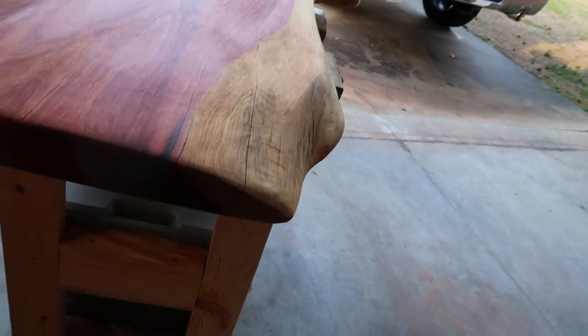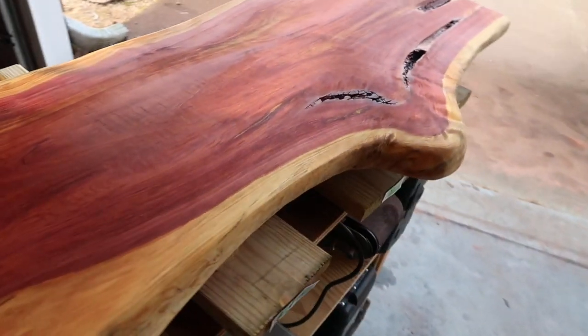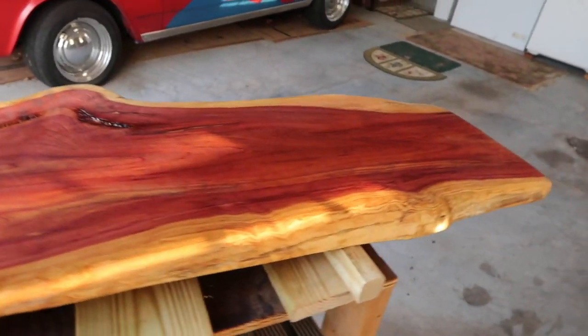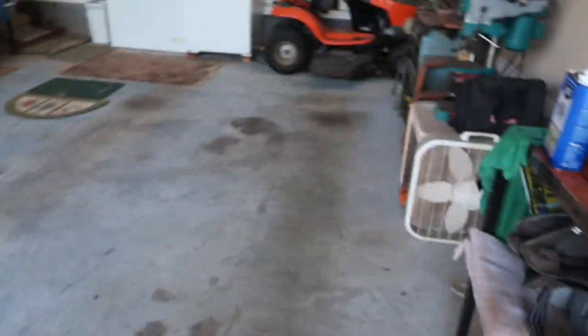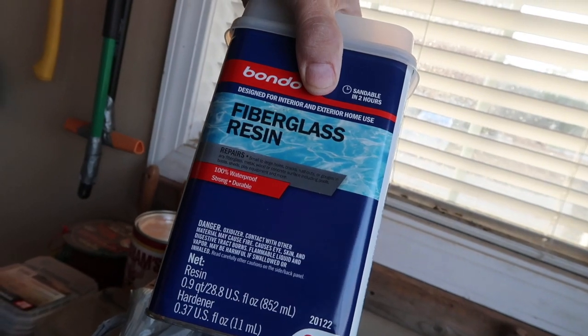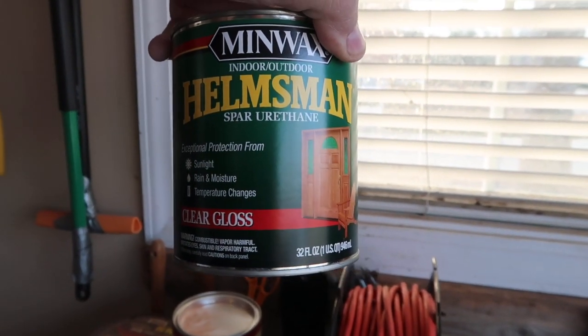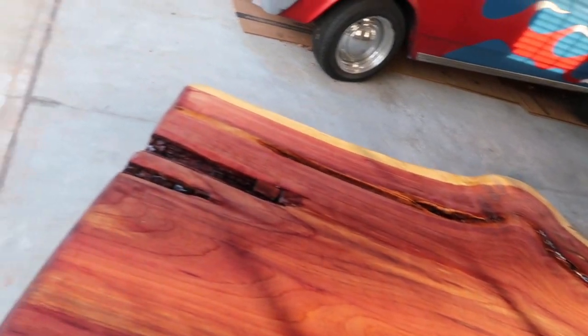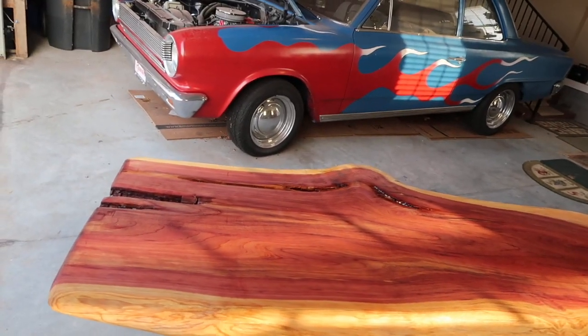With a good coating of proper mineral spirits, this cedar wood has got a beautiful finish to it. I've coated both sides and I'm going to let it dry really well. Then I bought some fiberglass resin — apparently it bonds to wood, concrete, fiberglass, and metal, and it's clear. And then I got this Helmsman clear gloss urethane, which Donna recommended — she did several coats. I also got blue tape to build up an edge so the resin dries flat but you can still see inside.